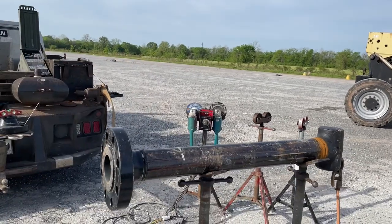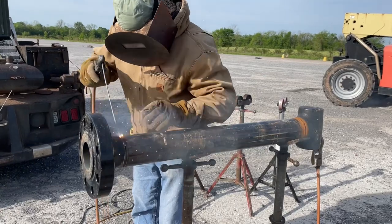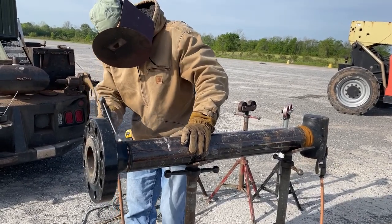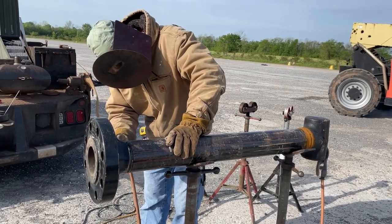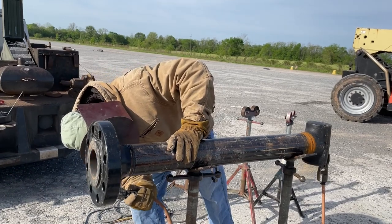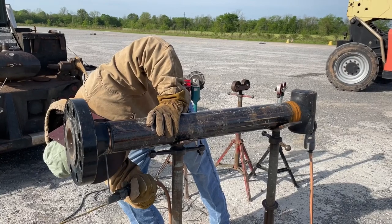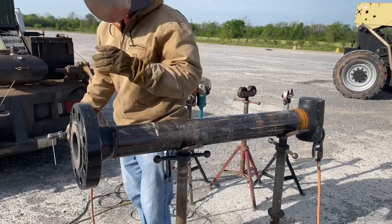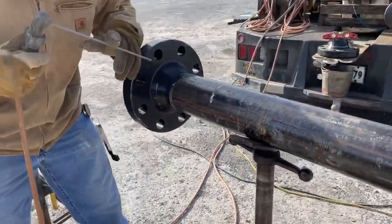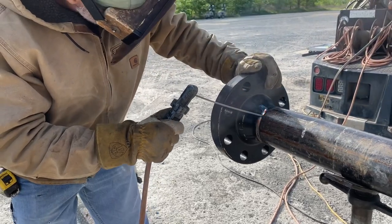I start off on the top leading it just a little bit, and as I get down on the side I notice my rod's pretty much straight in — it's funny, I didn't know that until I saw myself do it on video. But at the bottom I'm going to lead it, get the stinger ahead of the rod. Once you start getting this and do it successfully a couple times without stopping, it's going to be second nature — not a big deal anymore. I remember when I started it was a nightmare trying to make it from top to bottom, but just keep practicing. On this side, lead it just a little bit and then on the side, pretty much straight in.